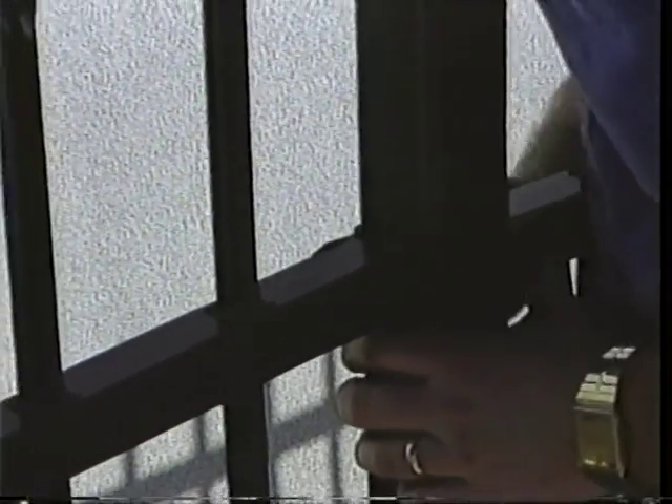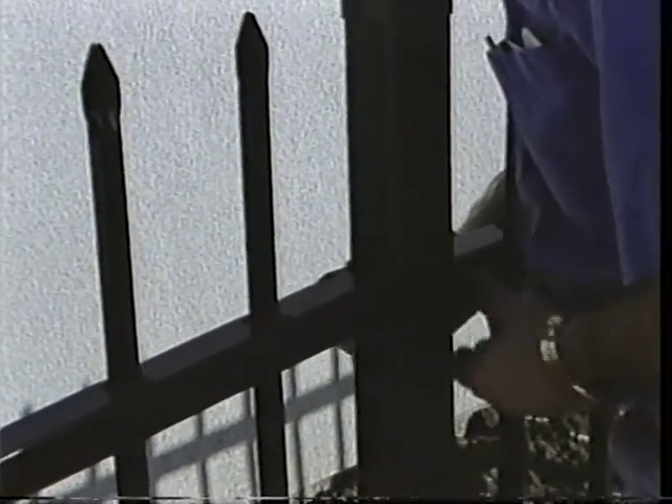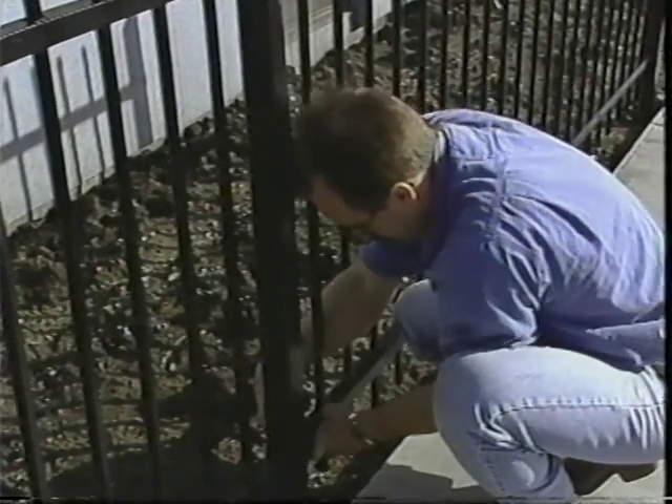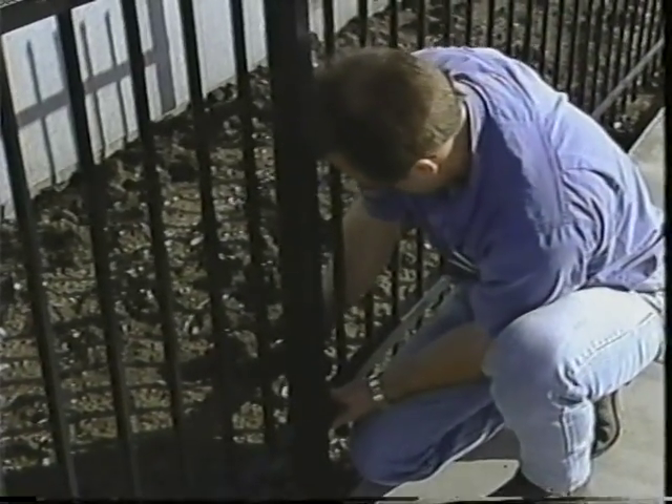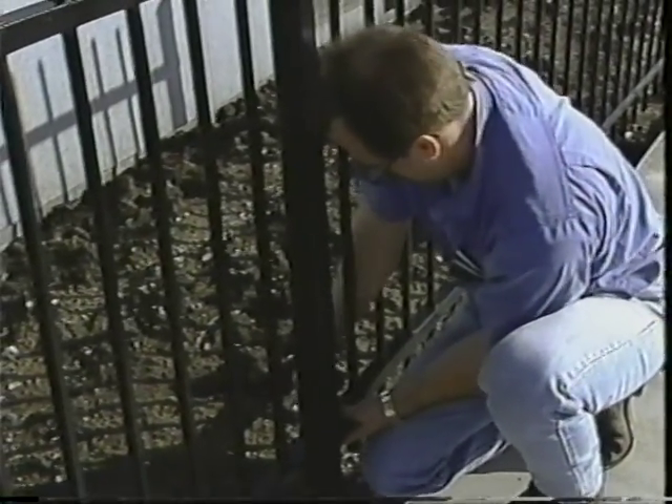Panels are set into place; the top brackets are applied loosely first, then fully tightened once the panel height has been appropriately set and leveled. Bottom brackets can be applied and tightened as the last step. Downward tension applied to the bottom rail during tightening ensures a rigid installation with no loose parts.